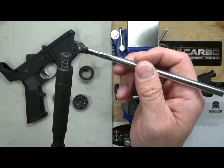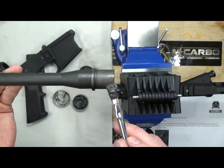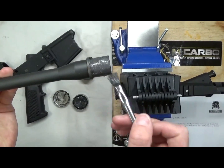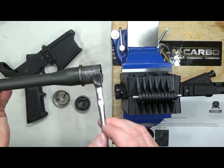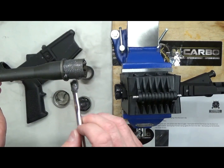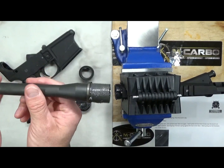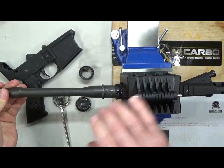And then the barrel itself — the piece that you're going to insert inside the aluminum upper receiver, where steel and aluminum meet — that's where you're at most risk for these two pieces welding themselves together after extreme heat and pressure over time. By the time that barrel's shot out, any other grease is going to be non-existent. So it's nice and lubricated. I've got the receiver all lubed up — slide the two right in there.